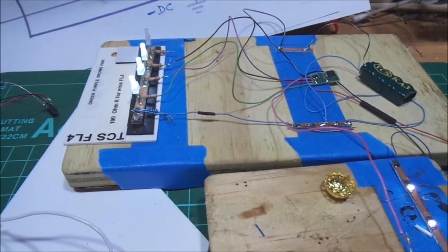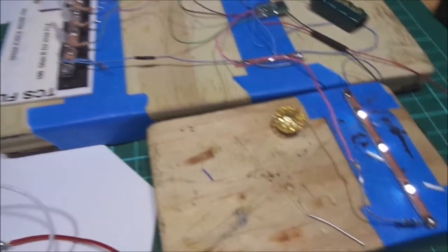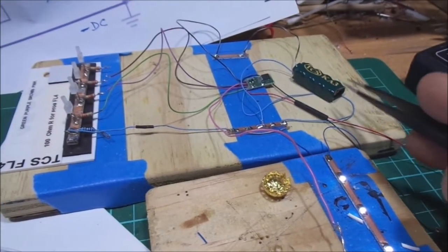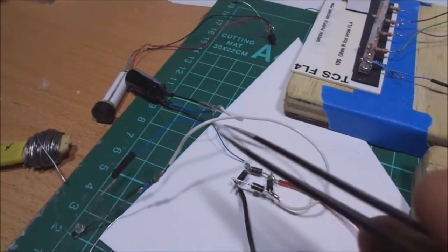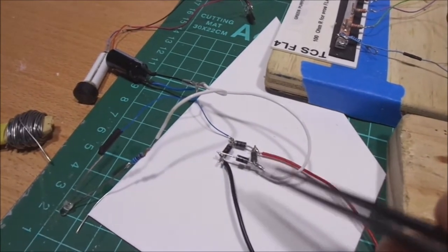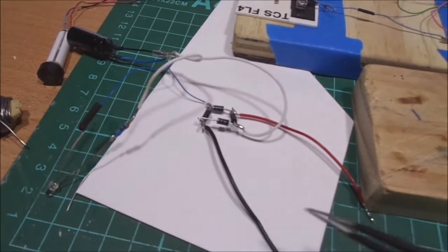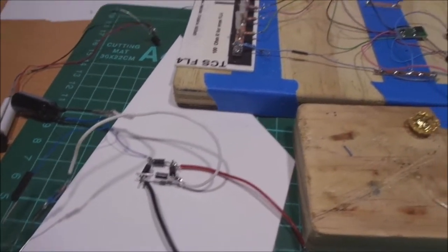So there we go — turning the lights on and off, and these ones down here turn those on and off. So either using a keep alive or you make your own bridge rectifier with a standard capacitor, you can do it that way. You can use surface mount diodes as well to keep down the size — that's not that hard to do — or you can actually buy surface mount bridge rectifiers, and that'll save you space inside your coach.